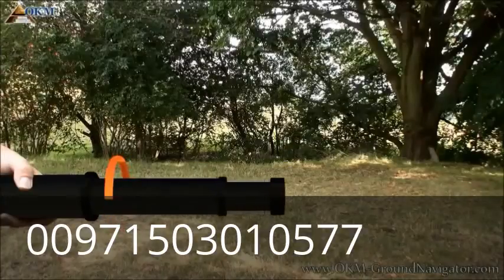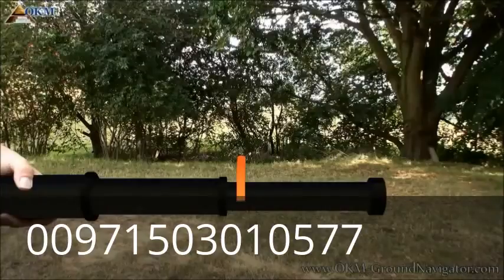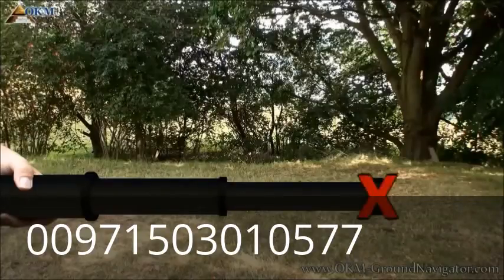Now you can pull the middle segment out of the upper one. Finally, you turn the middle segment back into place. Repeat this procedure with the lower part — remember, the left hand is still holding the upper part while the right hand turns the lower tube. Do not grab the end of the probe, because this will not turn the tube.